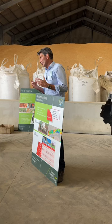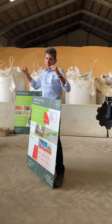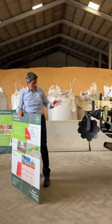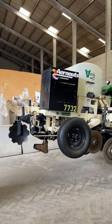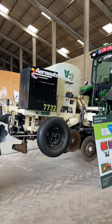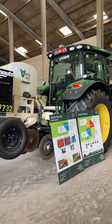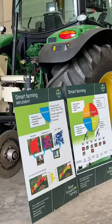So what does this machine do? In fact, it's sending electricity through the soil. This is the machine that they drive over the field, and you see these discs: electricity is sent through one disc and is captured by the other disc. And so we can measure the electroconductivity of the soil. And the electric conductivity is a proxy for yield potential.